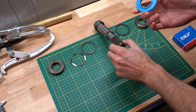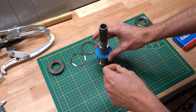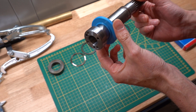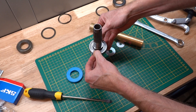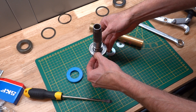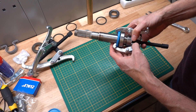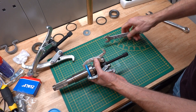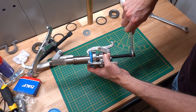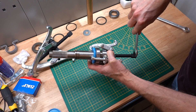In order to install the front bearing, quite a bit of force is required. I do not have a hydraulic press, so I used a pulley puller for this. Since this bearing was new, I did not want to risk putting any force on the outer race, which might damage the bearing. To prevent this, I printed a specifically shaped spacer that would only contact the inner race while tightening the puller. It was printed from regular PLA at 100% infill. I was not really expecting this to work, but it actually worked fine. I used a smaller type of puller to pull it over the last section, which did require a bit of force, but it made it all the way to the end.